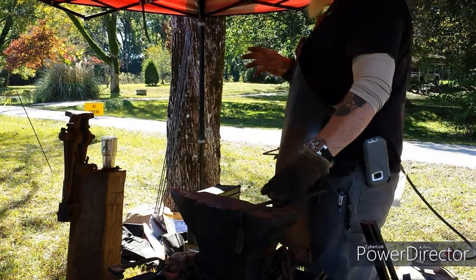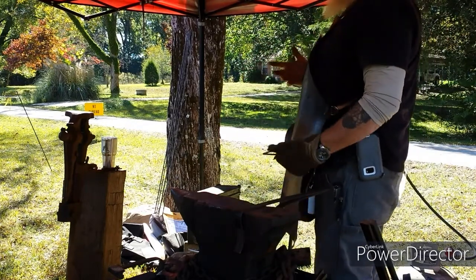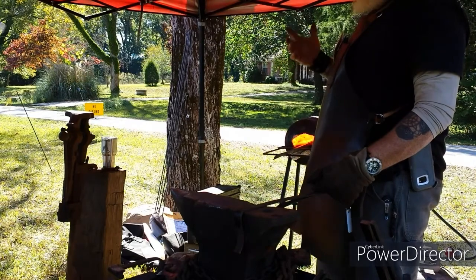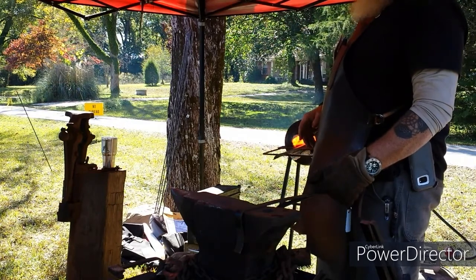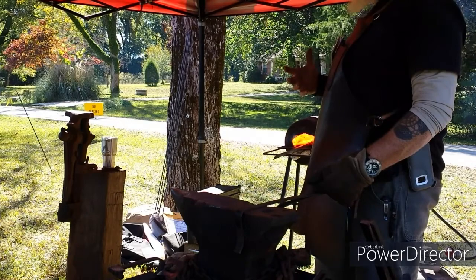They're still not the best to try to make knives out of. My go-to is a 1075, 1080. And when I do Damascus, I just use that, and toss in a 15N20 for the difference in pattern. Both of those are good quality steel for knife blades.